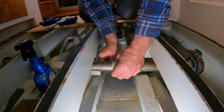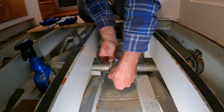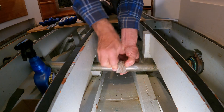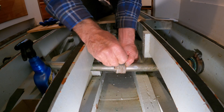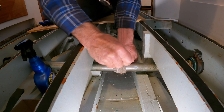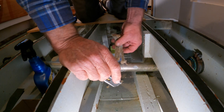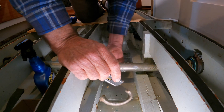The flax packing material comes in different sizes and it should fit easily into the packing nut. If you have to force the packing rings down into the nut, they are too tight — you should go with the next size down. Once you have determined the size of the packing that your boat needs, it should be recorded in the log book and extra packing should be kept on board.